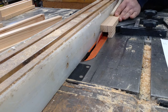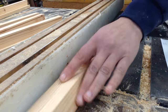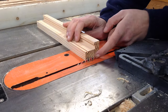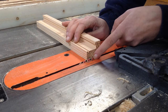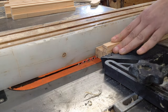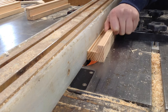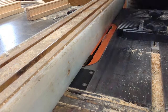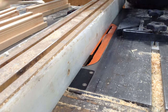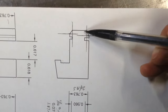All I did was set up that first cut — those little grooves. I measured everything off the dimensions, raised the blade, and sent it through. That is that cut. Once again I know that looked a little dangerous, but I still had the connection point between the fence and the table, and having those two contact points makes it easier — it's not really cantilevering because it can catch itself on the fence. For the cut on the other side it's much simpler because it could sit flat — same process, move the fence, send it through, and get that cut.